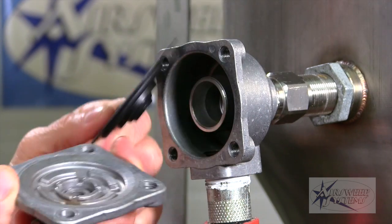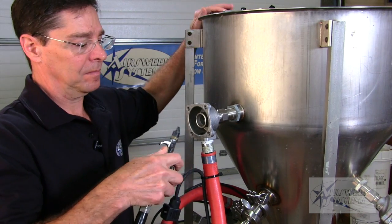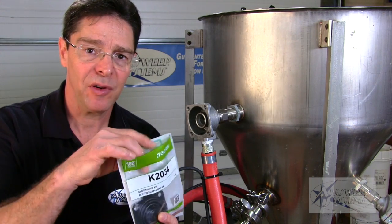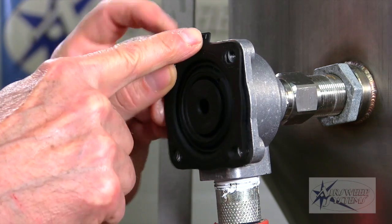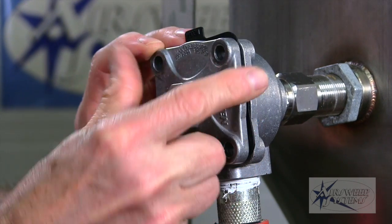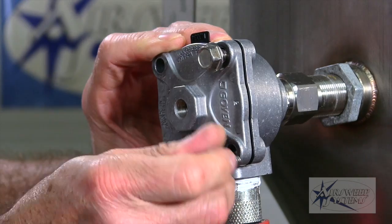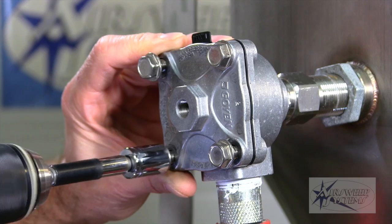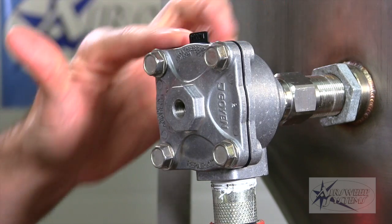There's the diaphragm. We're just going to blow out the inside of the diaphragm valve to make sure there's no debris in there, and replace the diaphragm. Per the manufacturer's instructions, the tab should be positioned opposite the air inlet. We're going to put the bonnet back on and screw it back into place. We tighten the cover in a cross pattern to make sure it's tightened evenly on the diaphragm, so we don't distort the cover or cause a leak.